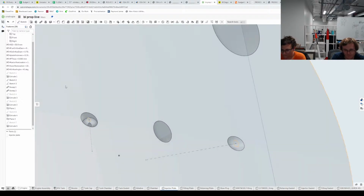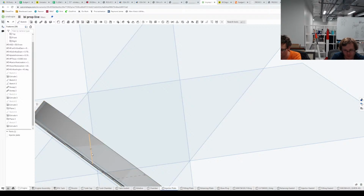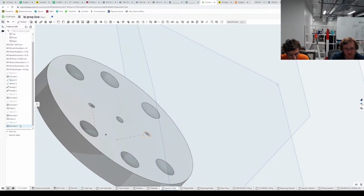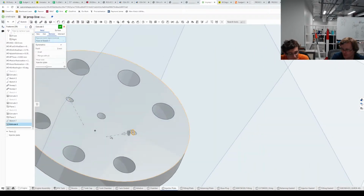The other thing is to end mill almost all the way down and only have to drill a little tiny piece. That actually might be the best course of action. End mill down there so that our drill bit only has to punch through that little tiny end piece of material. We don't have to drill through this 1/4 inch thick plate. Oh, I see what you mean.